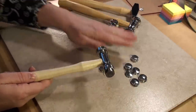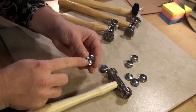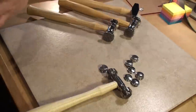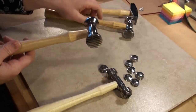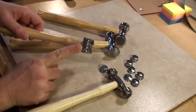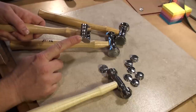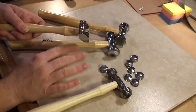The thing I like about this hammer is that I do get nine different heads. Some of these heads just have a single square, or a point, or a rounded edge, a circle, and this one has a little hollow point. You're going to have a little bit more control with those. These fixed hammers are great, but you only get two textures per hammer. I love the crosshatch with the diamonds; however, this particular pattern I have a very difficult time getting any kind of really good repeatable results with, so for me that end is not as good as some of the others.